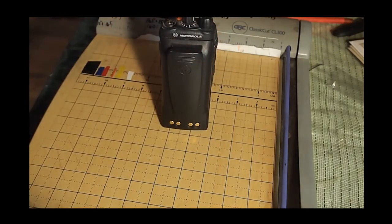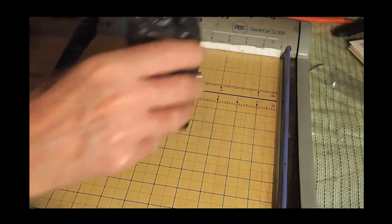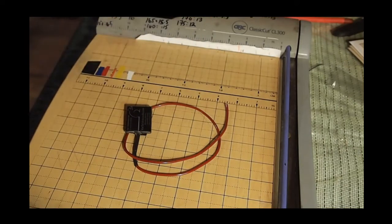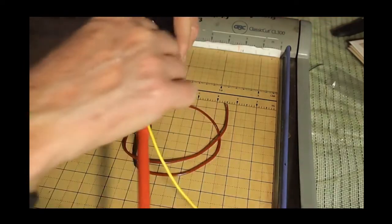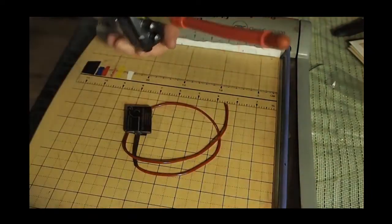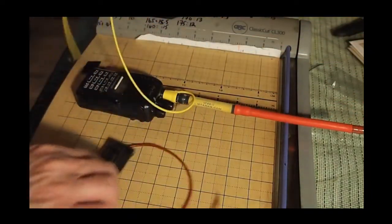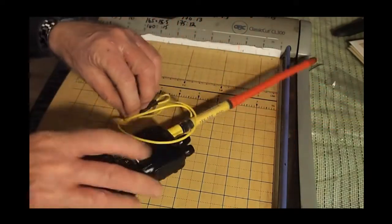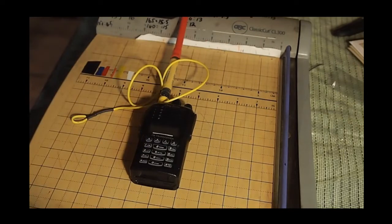So those are the differences. This boosts your signal from your radiating vertical element, and this provides a counterpoise, enhances the ground plane, and therefore also makes a significant difference to your signal propagation when you are on ground that doesn't provide for a very good ground plane.